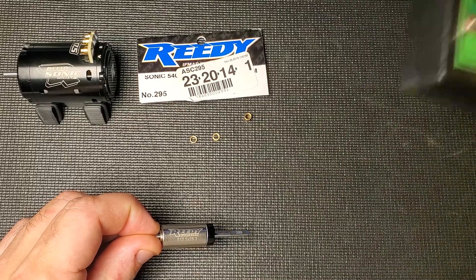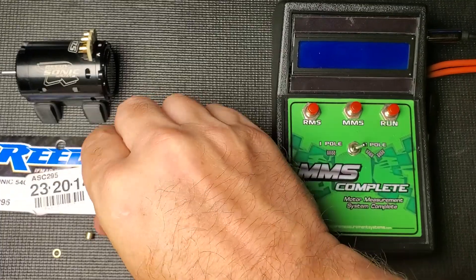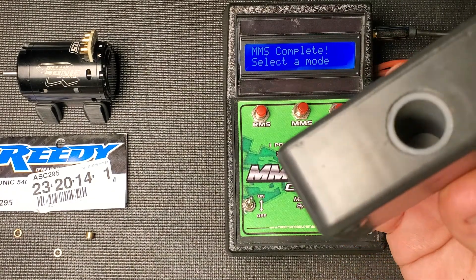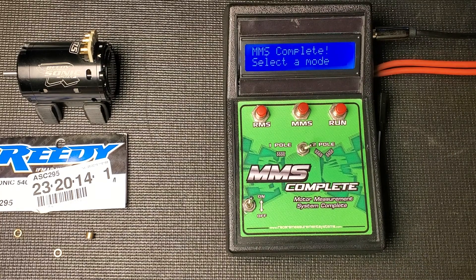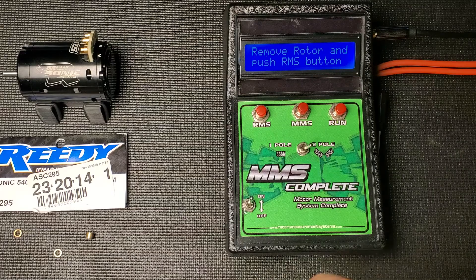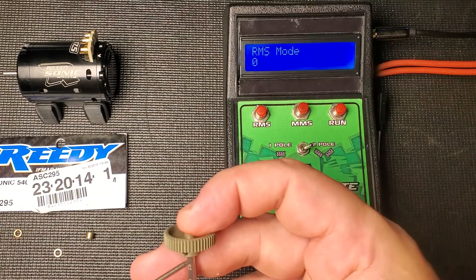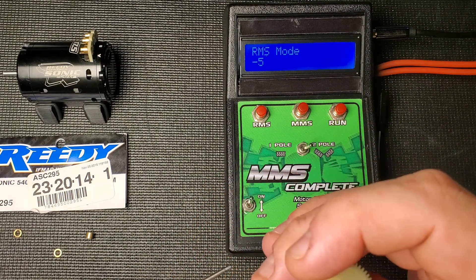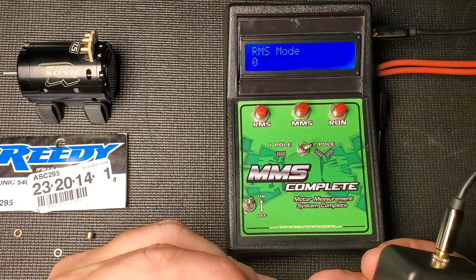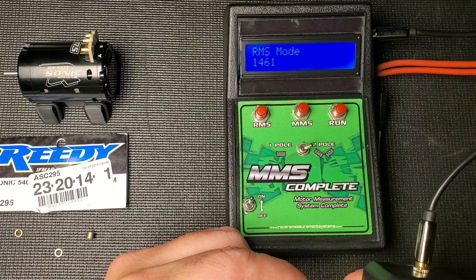Now I have a rotor tester. Let's just make some space here and get the rotor tester in place. The way this rotor tester works is I put the rotor in this holder and spin it around to see the max strength. I like to put a pinion on the rotor just to make it easier to work with. So I'll zero it. What we noticed before when we last tested, these were 1490-ish Gauss. I'll just flip it to the north side — we see 1470, 1450, 1480.